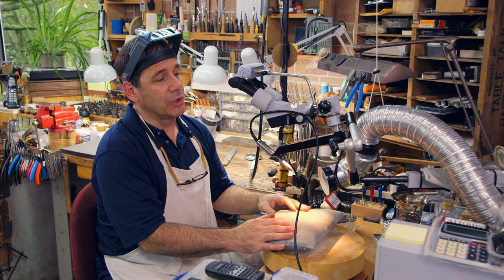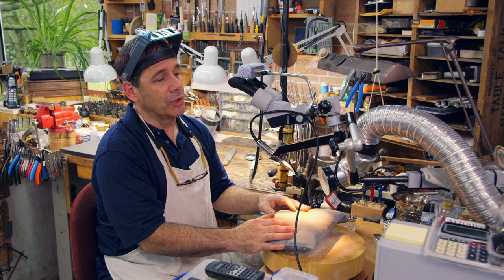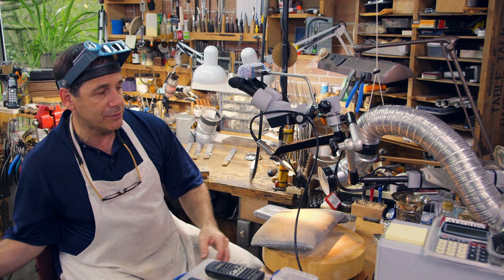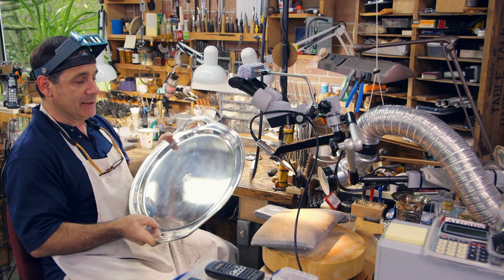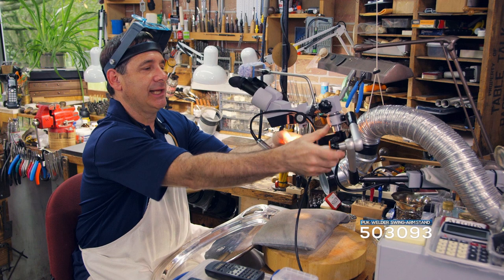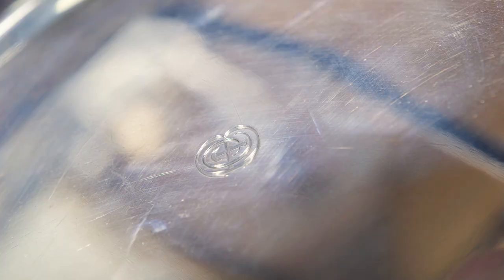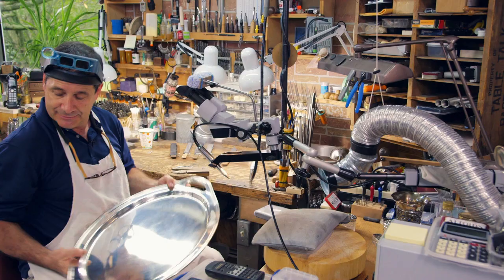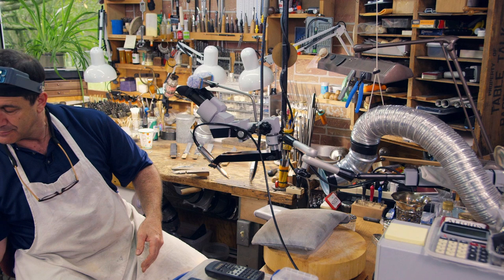What I also like about this over laser welders is that I can work on a very, very large piece. Laser welders tend to have compartments that are smaller and primarily jewelry-sized. So if I want to remove engraving — which I'm sometimes asked to do — from even a piece this size, a large tray, I can use my articulating arm, extend it all the way, and weld right out here looking through the microscope. I could never fit this in a laser welding cabinet.